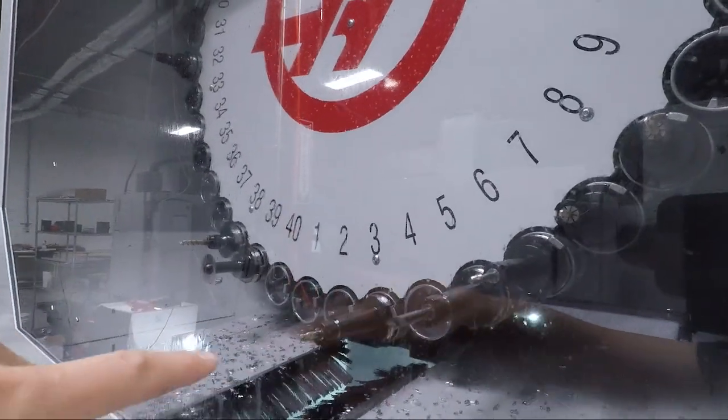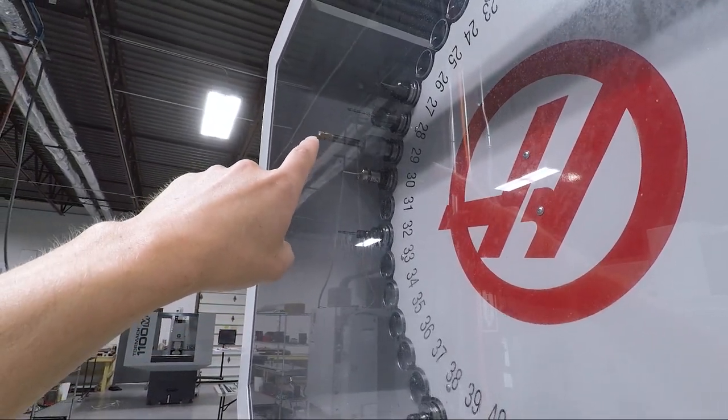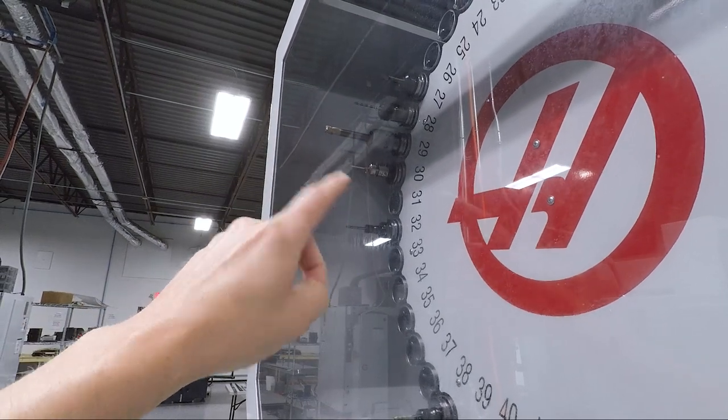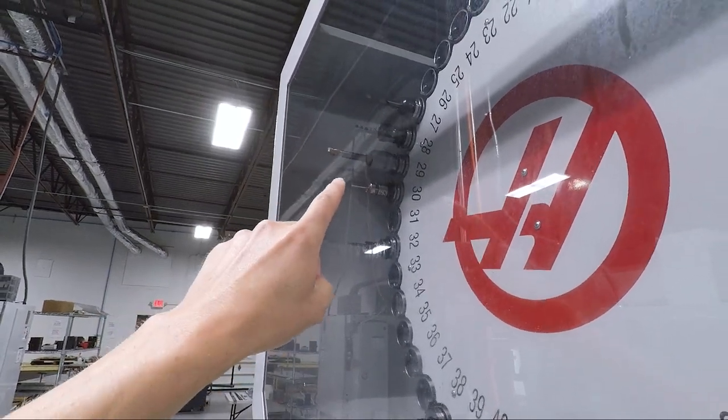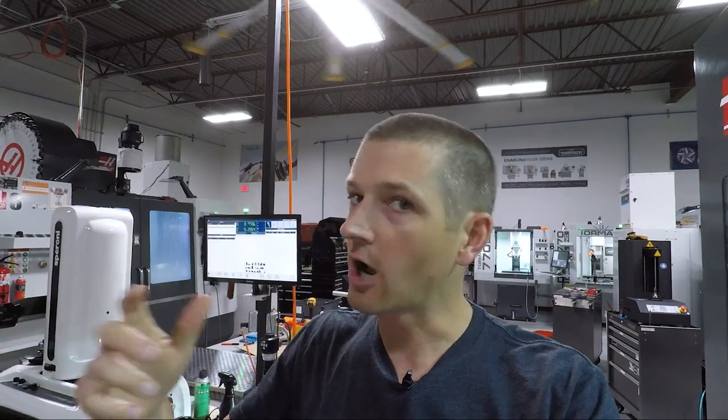I've got a slitting saw from Mari Tool — it's actually carbide, it's really awesome. And we've got a lot of longer gauge length tooling. That right there is a three-quarter inch, one-inch flute length, but it's a relieved shank with four and three-quarter inch stick out as a Helical tool. I am totally blown away at how much more rigid something is that's a carbide solid shank. You think about a traditional end mill — most of the time those shanks are steel, not carbide. Being carbide is way stiffer; solid is stiffer than having the flutes.